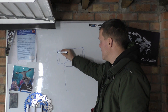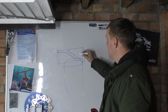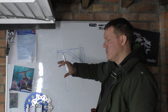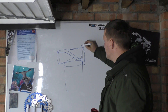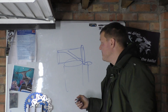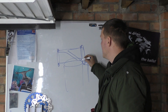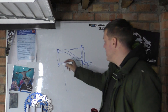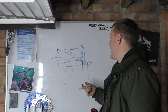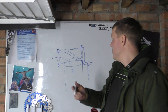Inside it basically looks like this. To speak simply, as you rotate it there's a drive gear that sits around here, then there's another gear that comes off a shaft — there are loads of ways you can do it. It has bearings here, here, and here to support it as it rotates. Basically your air goes in like this, and it runs at half crank speed, just like your camshaft.